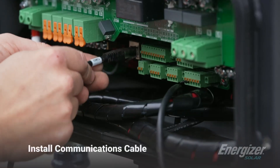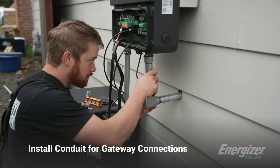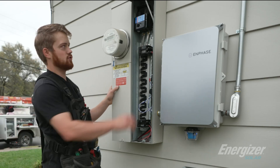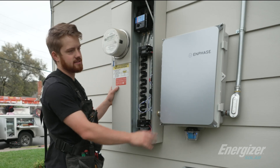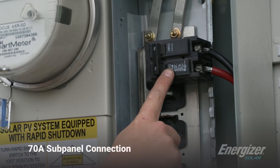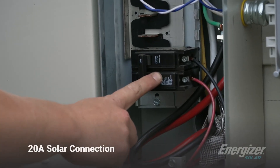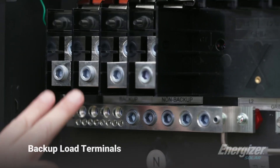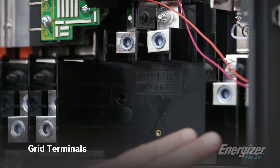What we're going to do now is run the connection between the inverter and the gateway near the meter. Here we have a 200 amp main service panel. Right now we're set up with 20 amps and this is going to be an in-phase AC coupled system that we're going to be tying into. We have our 70 amp sub panel and that's what we're going to be putting through our transfer switch — and this is the 20 amp solar. So here we have the gateway: it's kind of the hub of the whole system. We have our backup load terminal, our non-backup load terminal, your grid terminals, and your generator terminal as well.